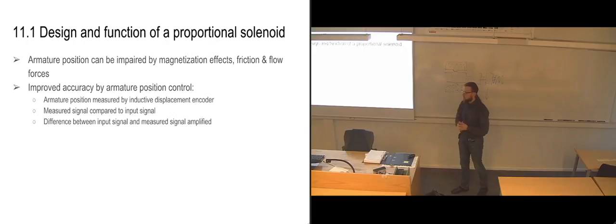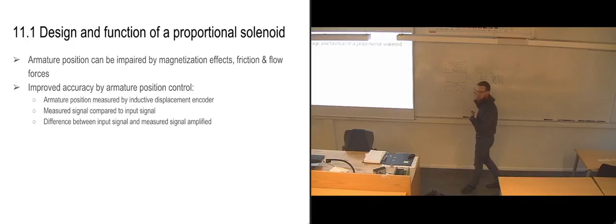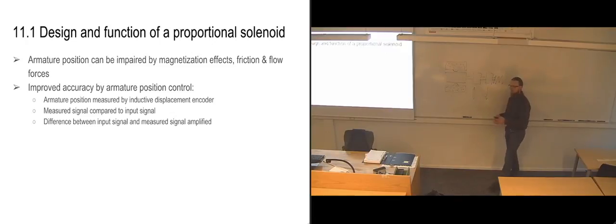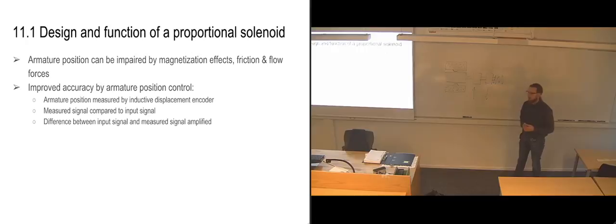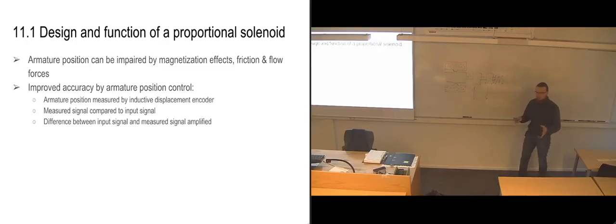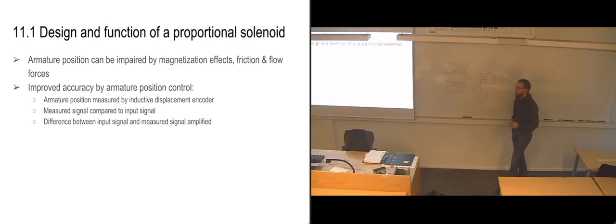But we were then told by the operators of the ROV that that was no problem. They would put it into their control systems that this exact port couldn't have more than 180 bars, so they would regulate it through their proportional valve instead. That meant we needed one fewer of the more expensive valves in our equipment. Even though the proportional valves themselves are pretty expensive, you can save a lot of money by using one expensive valve and not having to use quite a lot of other inexpensive valves. So the overall cost ends up being cheaper.